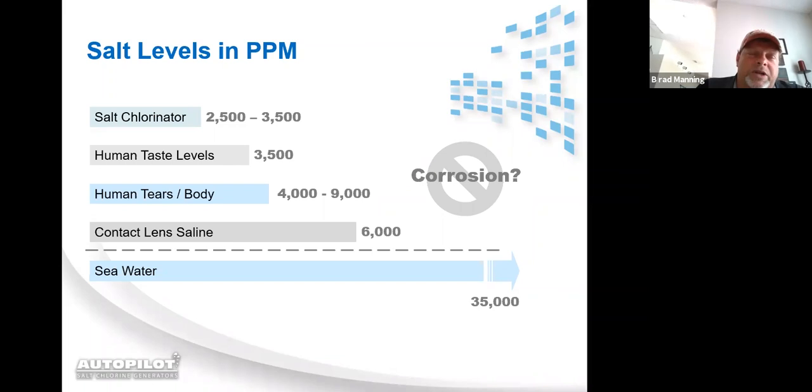And just remember, salt is not an exact science. Even as sophisticated as we are with taking water temperature into the equation of factoring out salt, it's not an exact science. We can be anywhere off between 400 to 600 parts per million. Also, the other reason I bring this up is because I get the question all the time: well, I use my handheld meter, and I'm always 200 to 300 parts per million off. Don't worry about that. When we're talking about salt differences, I'm talking about differences of 800 to 1,000 or greater.